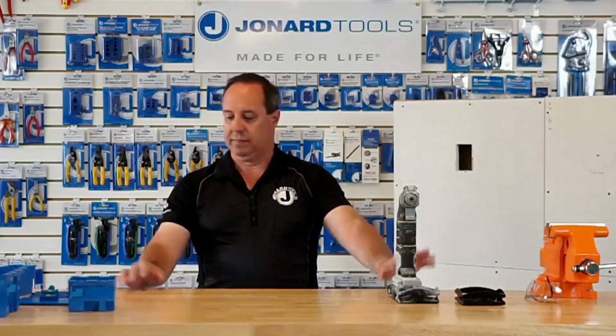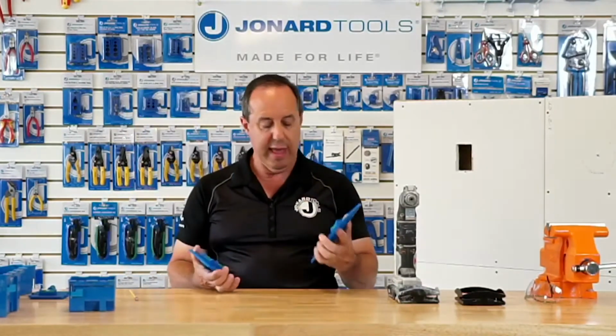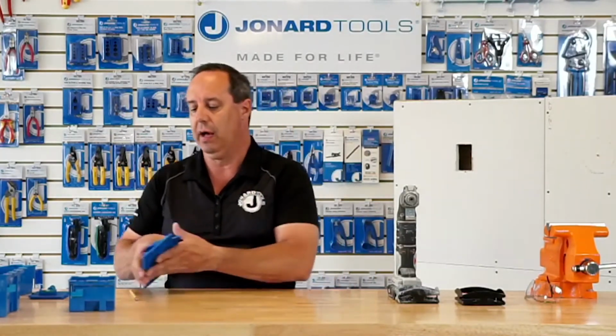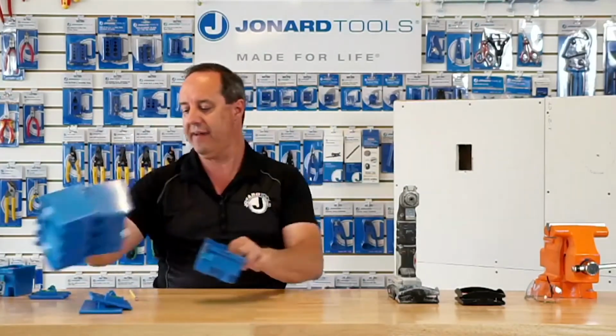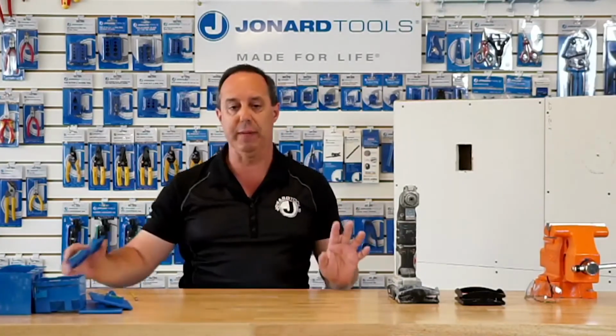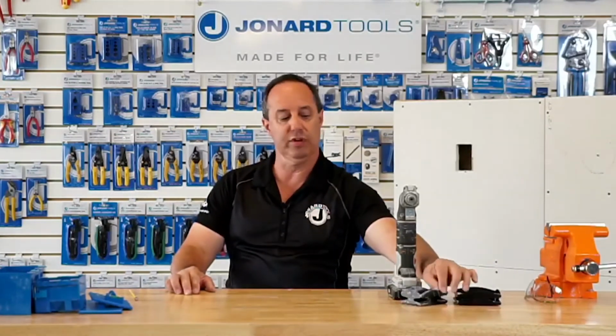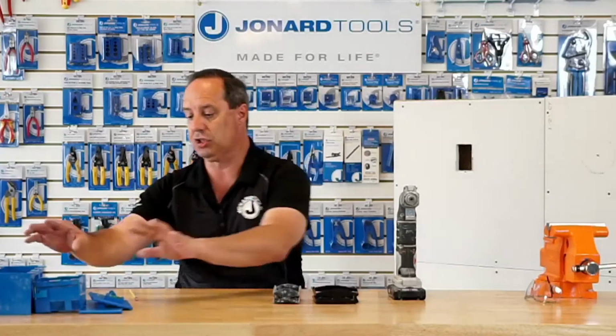One of the viewers asked, are these just for plastic boxes? Okay, the question being asked, are these just for the plastic boxes? The wall templates, the WTL 12 and WTL 34 are for the plastic existing construction boxes, like the ones I have here. The WTL 32M here is actually for a metal box, but there are many different sizes of metal boxes. It has to be for a 3x2 existing construction metal box. The EBC 400 and 800 here are really designed to follow the shape of the plastic boxes. So these are predominantly for the plastic boxes.